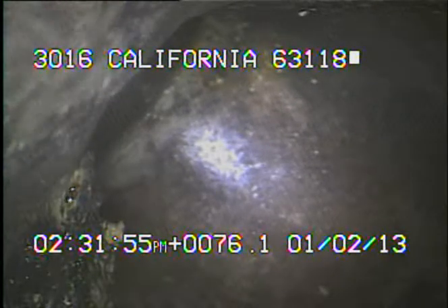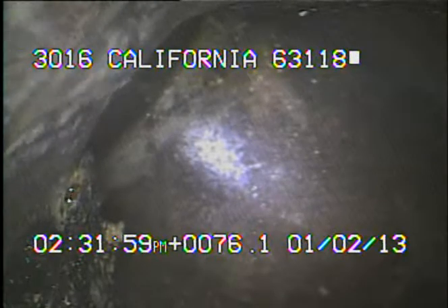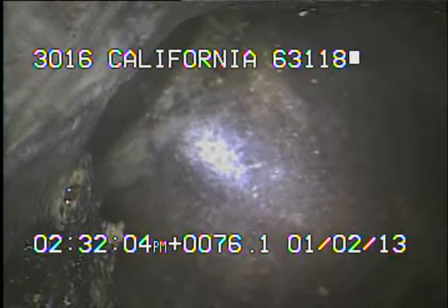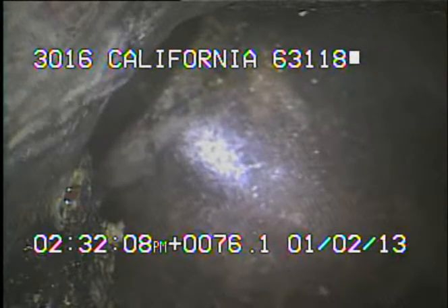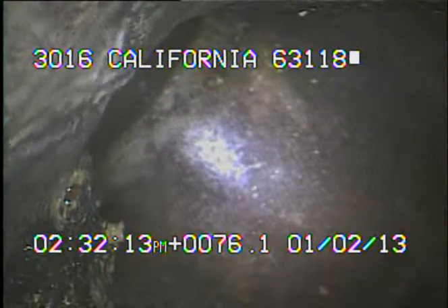Right here we're looking at a buried 6-inch yard vent. I've located this spot. The riser needs to be dug up to grade. Basically, what a yard vent is is a trap in the sewer line that actually goes down and up like a trap would. From there, on the back side of the trap, it goes out towards MSD's main.